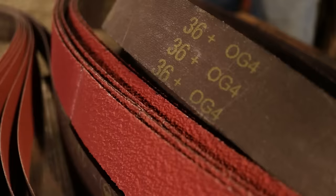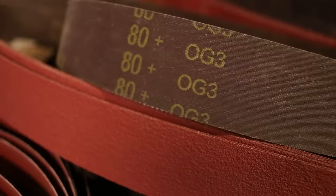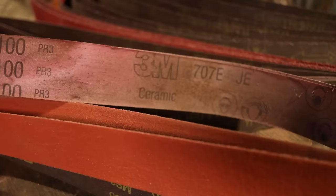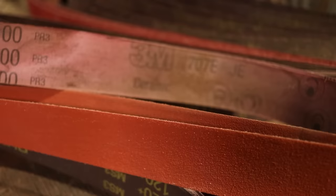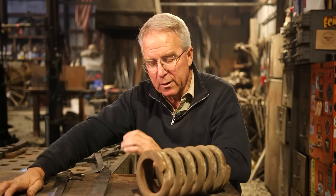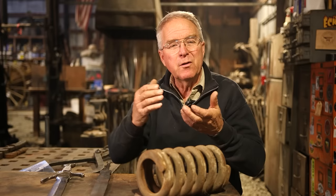The aluminum oxide belt is known as a shaped belt. The grits on a belt range from maybe 36 to 2,000 grit, which is an arcane measurement of the size of the mesh that the particles shake through when they're screened. They sort it, glue it onto the backing, and count the number of scratches that the various abrasives make on the work — that's how it's designated. As you go to a finer and finer grit, you get a smoother and smoother finish until you get to whatever makes you happy.